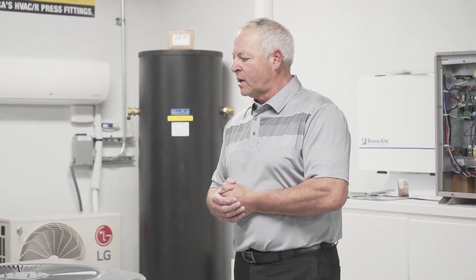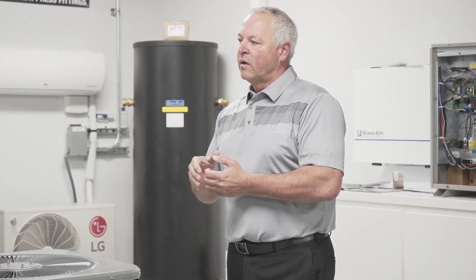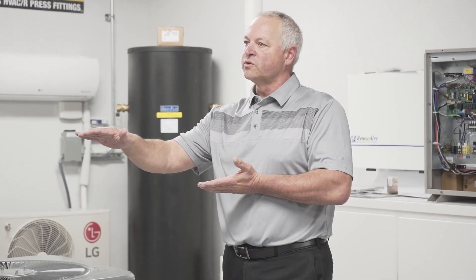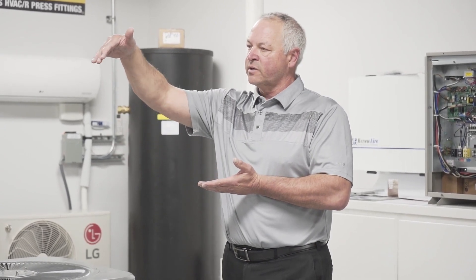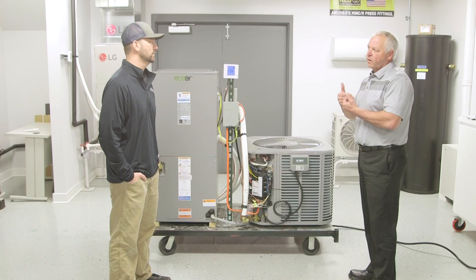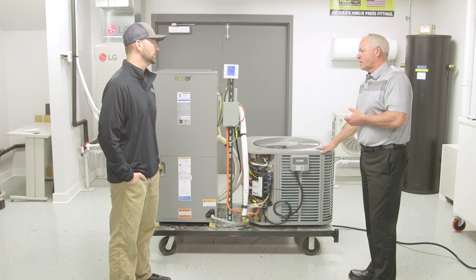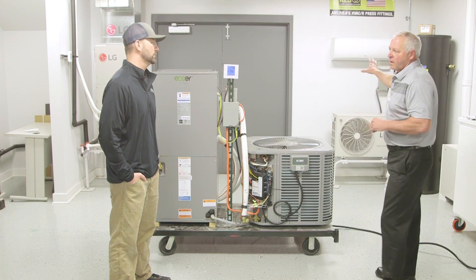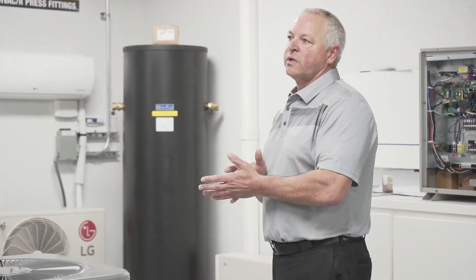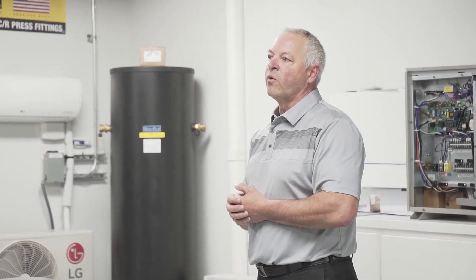That's been my experience with mini splits as well. When we first got into the market, what we talked about with inverter capability was like your car on cruise control on the highway — going 50 miles per hour, if you hit a hill, that's load on the engine; we simply send more gas to the engine to overcome that hill, and as we crest it, we take gas away. With this technology, it's the same type, but we're looking at a discharge temperature instead of using a delta T like a mini split would, making it a bit more simplistic in approach.